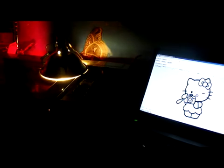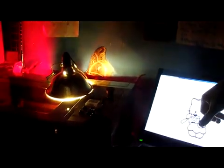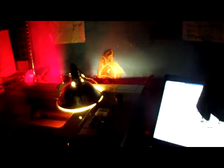And if all else works, so right now, sometimes it may not look like it's printing because it's only printing a small amount. Remember that it prints from left to right, and it starts where the black is. So if it looks like it's not printing in the beginning, give it some time and see if it's sparking. If it's not sparking, what you can do to troubleshoot is adjust the intensity to see if the intensity is on or off, to make sure there is some intensity going to it. In addition to that, you can also hit the laser switch right here. Sometimes the laser switch is off and you have to hit it to turn it on. The third thing that you can do is check to see if the emergency stop is on. If it's on, just depress it and then print.